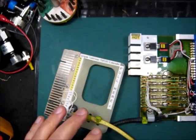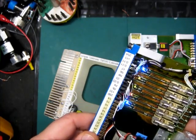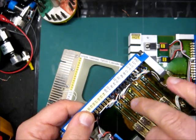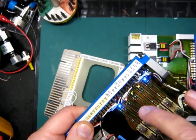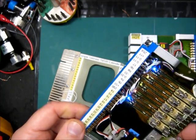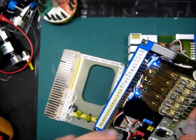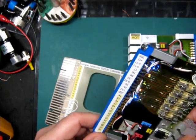I have printed labels to identify the pinout of the connector. I built two of them because for double plugins I need two. Here for example I have one plugged into a mainframe and you can see all the LEDs for the 25 volts, the 11 volts, and the minus and positive 33 volts. It can be used with TM500 and TM5000 series — even on the TM5000 where the voltage is lower, it works the same way.